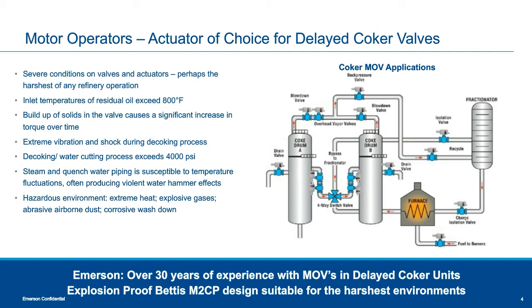The coke product naturally has traces of sulfur which can be corrosive when subjected to water during unit washdown. This process also produces airborne dust covering all surfaces within the immediate surroundings. The coke dust creates challenges for corrosion protection and builds up in crevices, impeding instrument functionality. In addition to the harsh conditions, the area for equipment maintenance is confined, hot, and potentially dangerous. Selection of a suitably designed and sized motor operator is therefore critical to ensure reliability and safety of the coker unit.